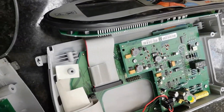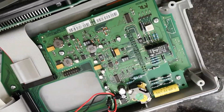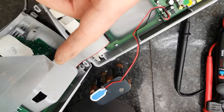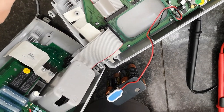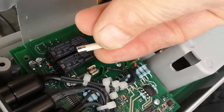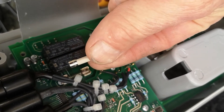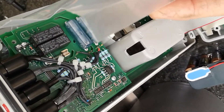The fuse in the power supply alongside the battery compartment checked out okay. Got in touch with Mega and they said parts are no longer available for this — it's basically a dinosaur unit. But lo and behold, on carefully taking it apart, I found an internal fuse located just there. This is the old one in my hand and the replacement one I've just put in. I'm hoping that this is the solution.